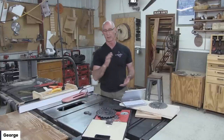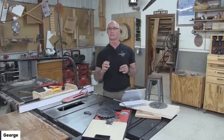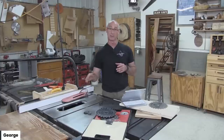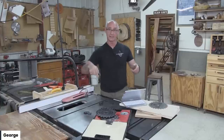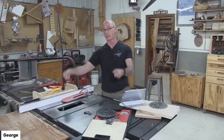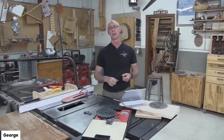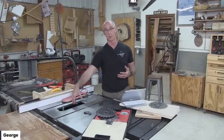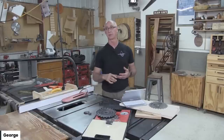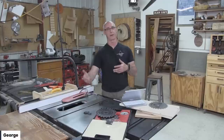So yeah, you need to check the specs on the saw. And the bottom line is that with a lot of benchtop saws, you're looking at the body of the saw. You can pick the whole thing up, put it on sawhorses or a stand, easily carry it in and out of your truck. Many of those machines have a universal motor, not an induction motor. Bigger saws have induction motors. So as a result, maybe they don't have the horsepower this one has. It takes a fair bit of horsepower to drive a dado head.